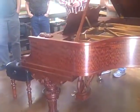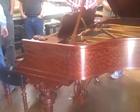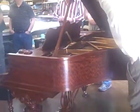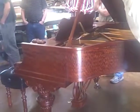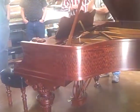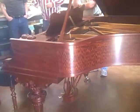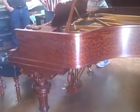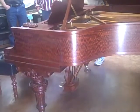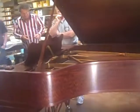And this is a normal thing for Steinway pianos because like that 1918 model, if that was a mahogany piano, all the main surfaces would have been mahogany veneered, but the legs and lyre would still have been maple. Even if it's not an ornamental leg like this, there are a lot of those late 19th century and early 20th century pianos where they would use a different wood for the legs, or there'd be random case parts like the lid prop. So if you do a lot of case restoration on old pianos, you have to come up with some way to get the colors to blend.